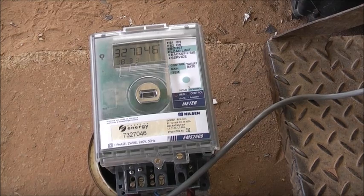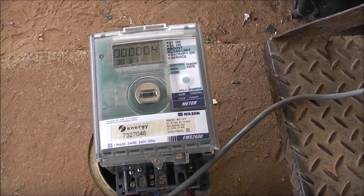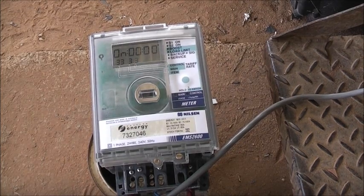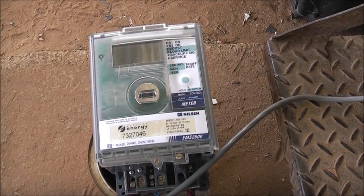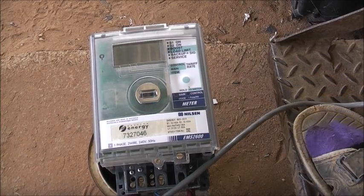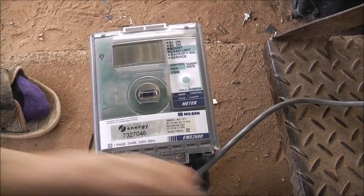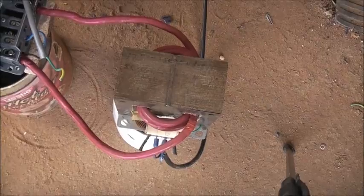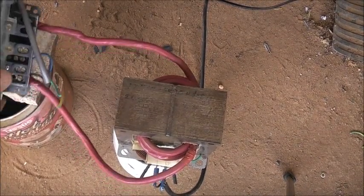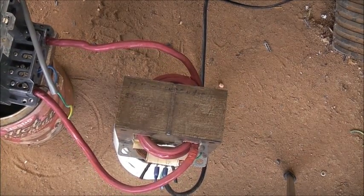Let's just prop that fan up there. Unplug everything — it's getting a bit too melted, that secondary. Unplug that — safety first. This secondary is virtually bloody melted together. That's one smoky meter, look at that — it's bloody smoking. Let me feel the back of the meter — things got warm in there. Let's tear it apart and see what the sensor and current load bits are.